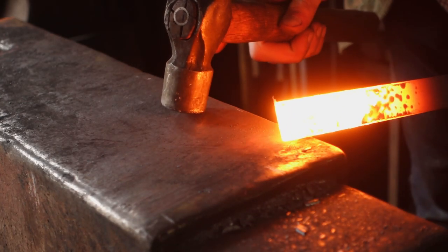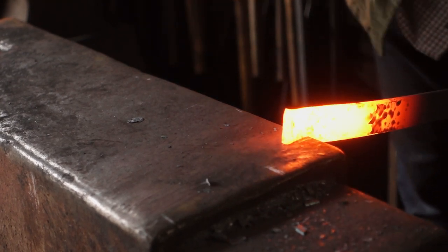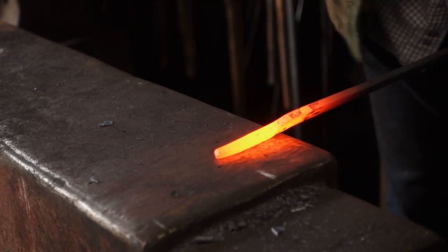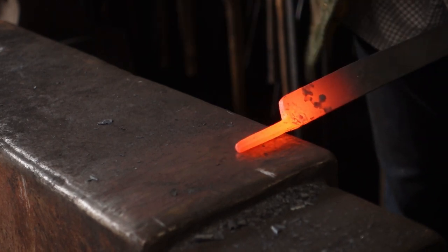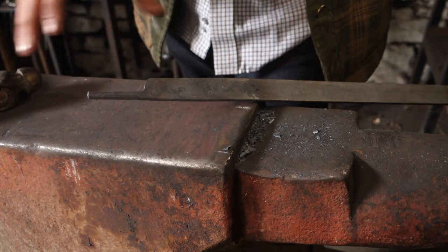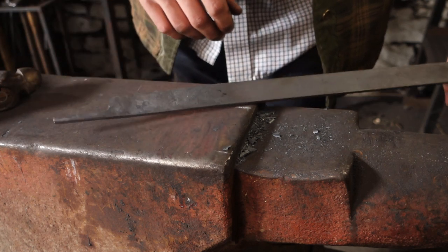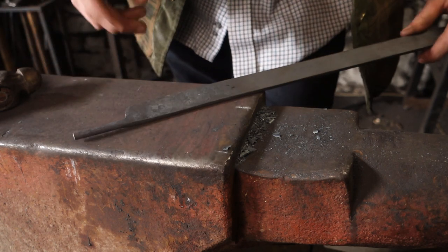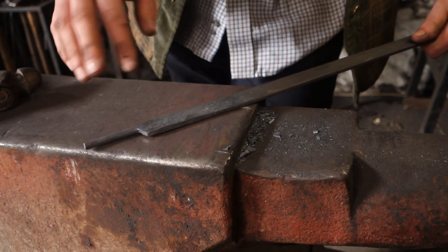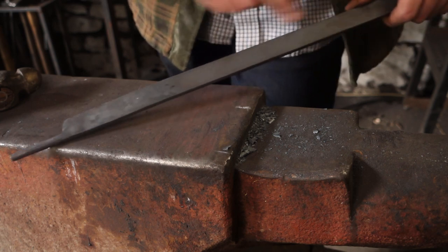I'll come on the near edge to make this isolation. I'll take about a cube of material - I don't think it wants to be that long, really. Viking rudders are often narrower at the top and then wider towards the bottom, so I need to forge a reverse taper coming back, and they do have a bevel on both sides. It may be that I need to come back with a grinder to neaten the profile up, and then obviously I need to cut it off from this handleable length.